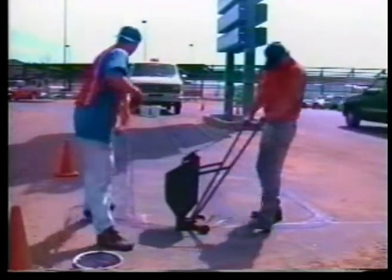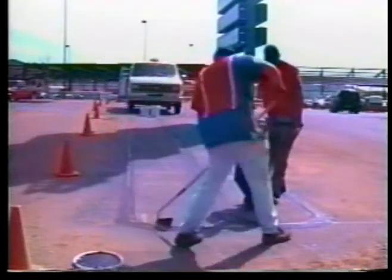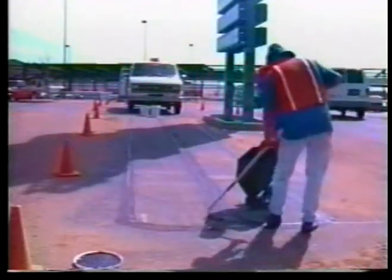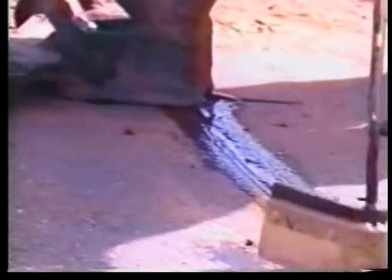Approximately 5 to 7 gallons will seal a 6-foot by 40-foot loop and the home run. Your results may vary depending on the width and depth of the slot, length of the home run, and application technique. Continue until the entire loop is sealed. On average, you should be able to seal a 6 by 40-foot loop in less than 3 minutes.